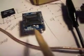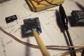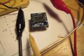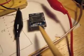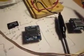So on the working one I jumpered on the 3.3 volts point here, so now it's soldered across there, bridging the gap. So we get our 3.3 in here, it goes to the center leg there and out and into the circuit itself. Mechanically there's some major issues.